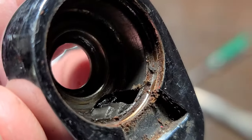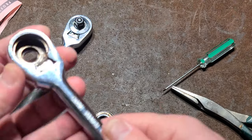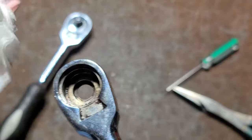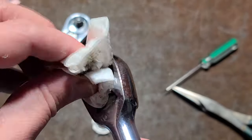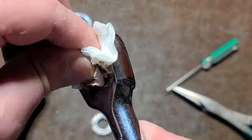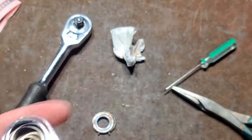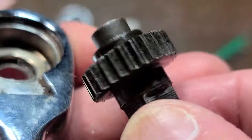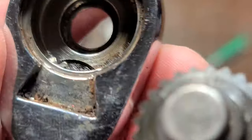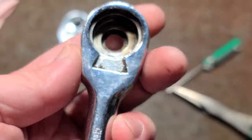Here's the retaining ring with just a little cutout for the clip. And here's our little anvil. We can see the two-toothed pawl in there. It still worked pretty good, but it definitely needed a little bit of a cleanup. Of course, some real light lube. I don't do too much cleaning up on these old ratchets. We've got so many ratchets, and these usually aren't ones I use very much, so I just do a light little cleanup. Ultimately coarse teeth, but they are pretty strong, and I do like that the pawl has two-toothed engagement, so that makes it fairly robust.